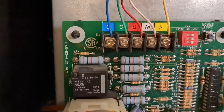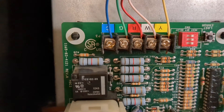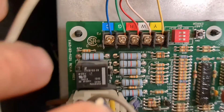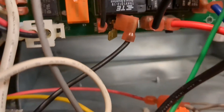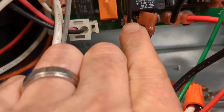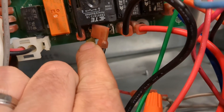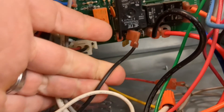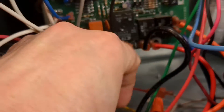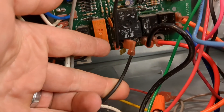These are your thermostat connections here. The red R wire is what we're going to need to pay attention to, so remember this wire. Down here at the bottom, it does say 'line' underneath on one of those terminals — that is 120 hot coming into the furnace. Be very careful with this. We want no accidents out there whatsoever, and Andy's Corner HVAC does always recommend having a licensed professional take care of any of these issues.